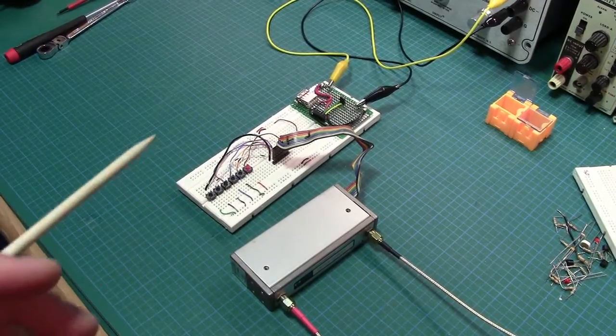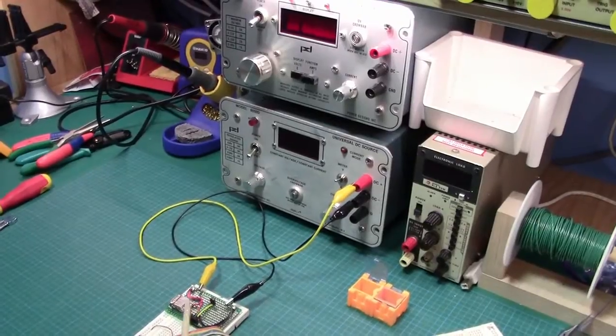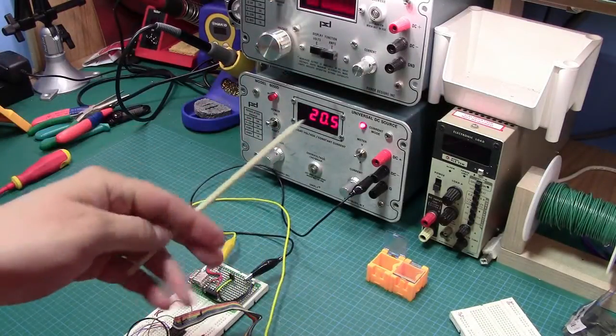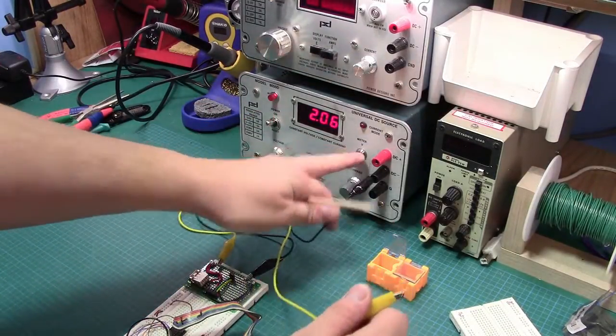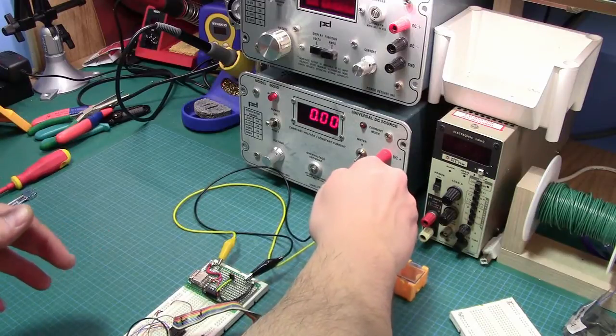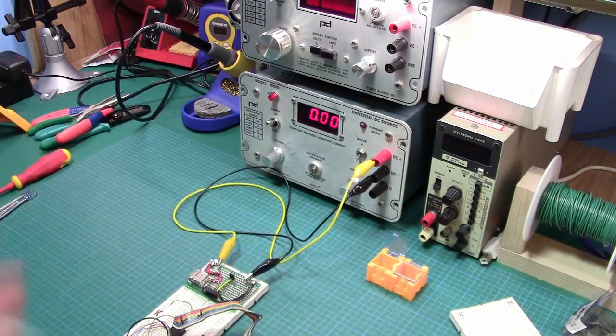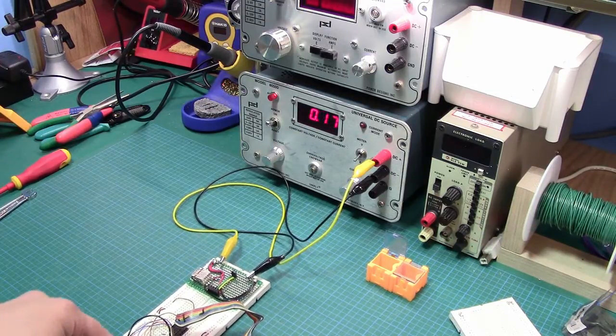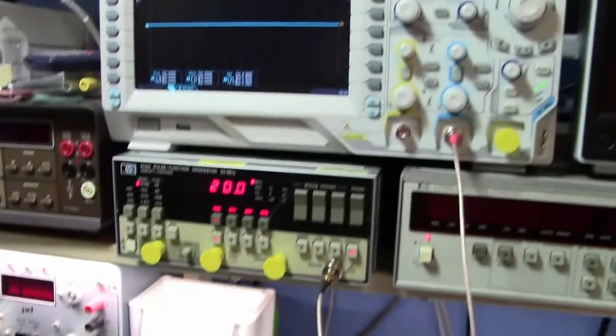So plugged into this, we're going to provide power here with our trusty bench supply, and I get to show this guy off. I love this one. So we're going to set this for just over 20 volts, and right now the limit is set for about 0.5, 0.7 amps. So we'll go ahead and plug that in right now. Of course, we should be taking nothing because we're not using anything. If we were to try and bring one out, there you go, you can hear that attenuator. But as we bring that in and out, you're going to see it's going to use some current. So we're going to just do a quick check now of the test and measurement setup.